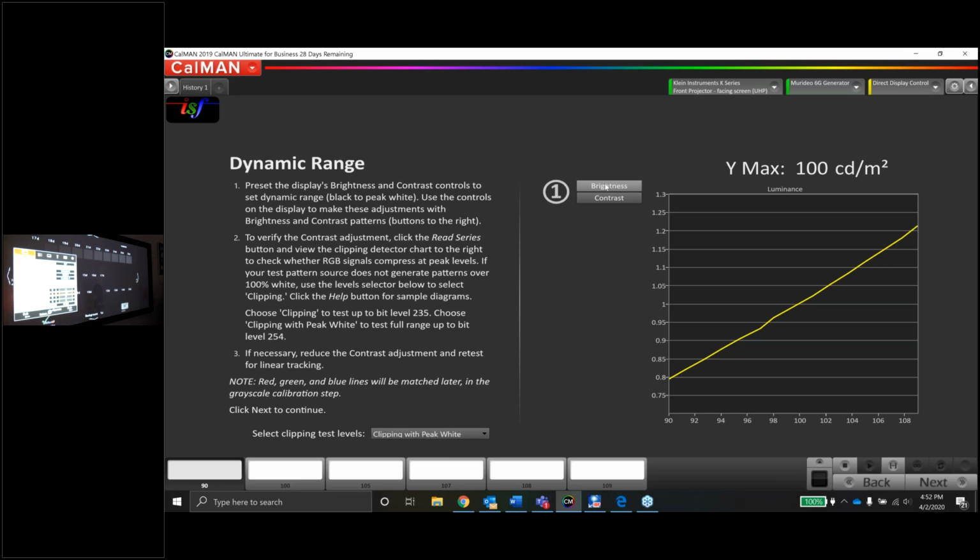Now, the good part is here, guys, what I'm noticing just with my eyes, as I turn the brightness up to see number 17, the background did not get gray. The background actually stayed pretty black, so that's good. A lot of times on a lot of flat panels especially, and even some projectors, when you turn the black level up to see that 17 box, the background gets lighter as well. So in case of like an OLED, if you turn the brightness up too high, you've ruined the black levels of the TV, and that was kind of the whole point. But in this case, this was actually pretty cool. I was able to bring the brightness up 6 clicks without making the background dark gray or light gray, and now I can see 17 no problem.